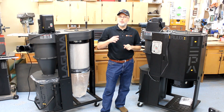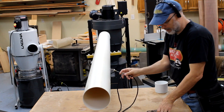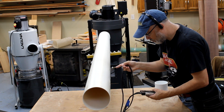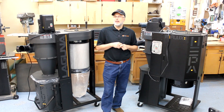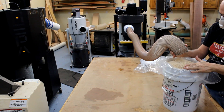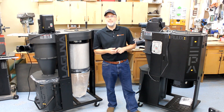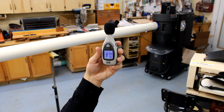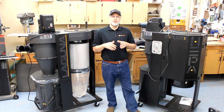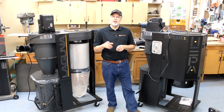There are four areas that we really focused on in testing around these units. The areas are airflow — we measure the airflow of each unit in a variety of static pressure configurations so you can get a sense of how it will perform in your shop environment. Also air-dust separation, which measures how much dust ends up in the bin versus how much gets thrown into the filter where it would clog it up and bring down performance over time. Noise levels, and finally the features and functionality of the unit in terms of using and maintaining the dust collectors in your shop.